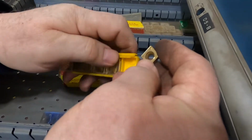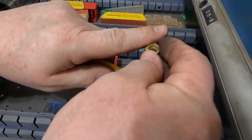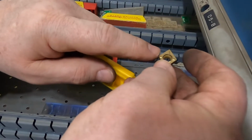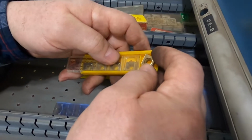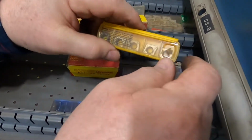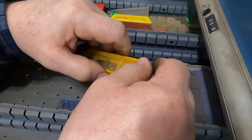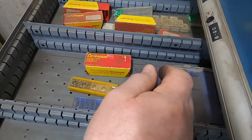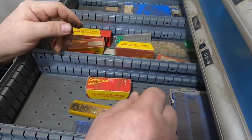I have a complete drawer where we put worn out inserts, and if we use these and we've worn out these, they'll be over there in the worn out drawers so we can still use the others later if we ever have a cutter or make a cutter for that. But the cutter that these were originally meant for, where you could do both real easy, it doesn't readily exist. They used to sell them in sets when these first became popular, and it got dropped because people weren't using them. It's got a purpose in facing.